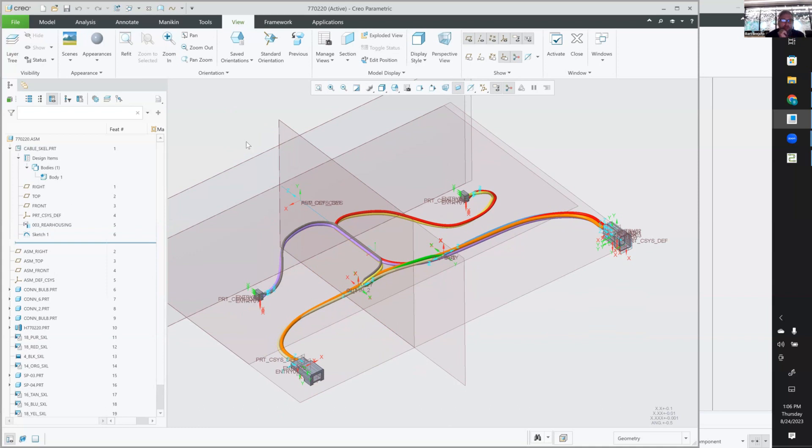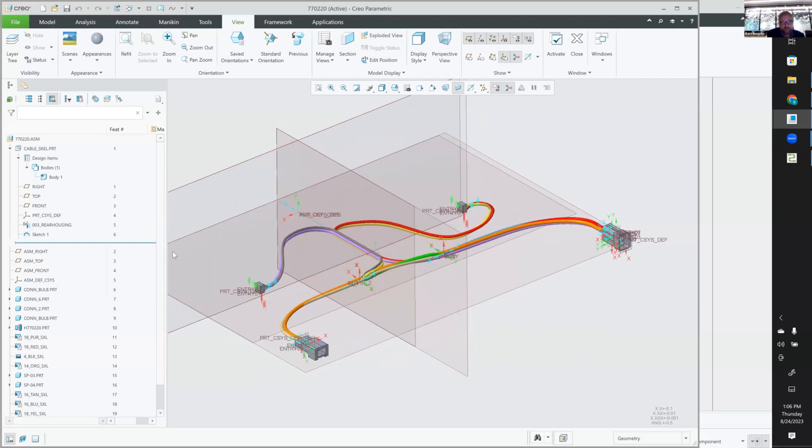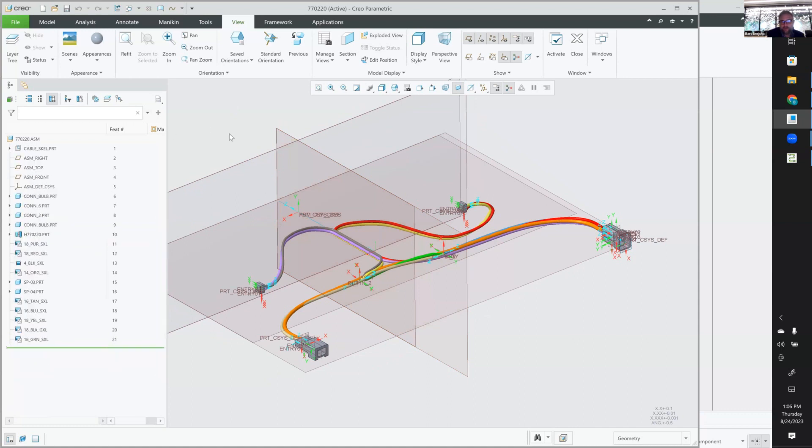In many cases I'm expected to route my cables through a 3D assembly, and the bulkheads haven't even been determined yet. So what do I do? I know there are probably going to be four bulkheads, so I'll just extrude surfaces and fake those as bulkheads. Then I route my wires through that. That way I'm able to design my cables through an aircraft that doesn't exist yet. Then I'll freeze my skeleton file so it doesn't continually fail, and I get to claim the space along the fuselage or along the fuel tank in the wing.